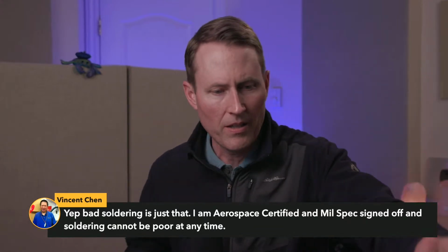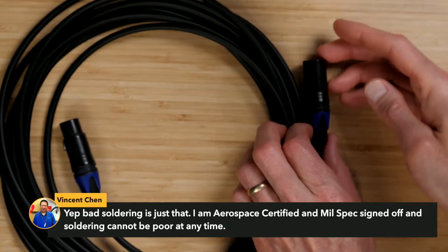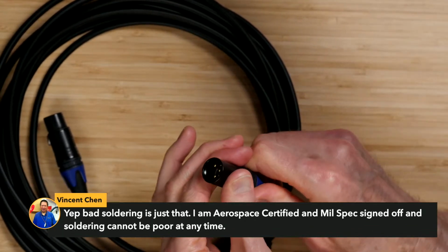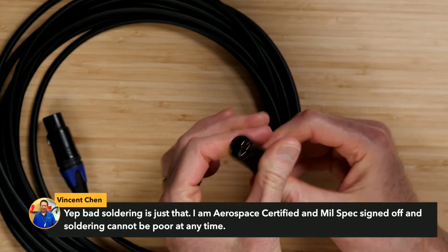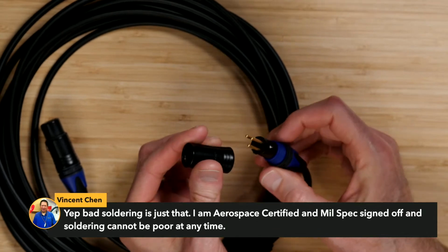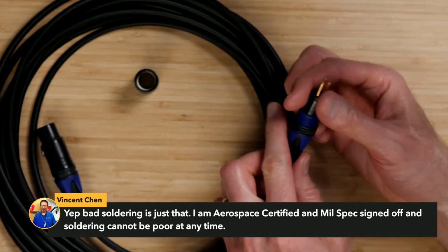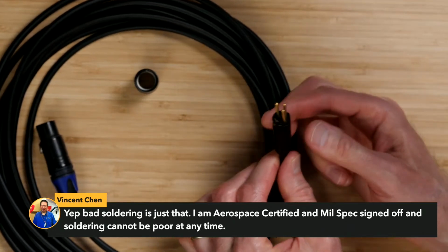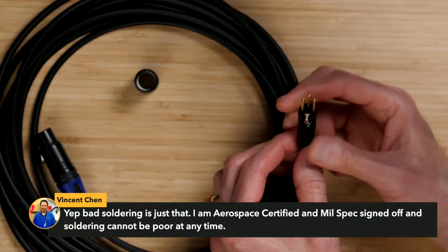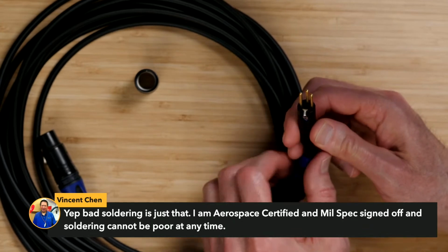Grab this cable again and come back to our overhead camera. I can actually disconnect or untwist this. This one's on nice and tightly. There we go. There is also a strain relief bit in here. So here is the metal barrel. Here's this sleeve right here, and there's a strain relief as well. And this gets pinched inside of here when you tighten it up, so that pulling on the cable shouldn't stress the solder joints, but sometimes it does.